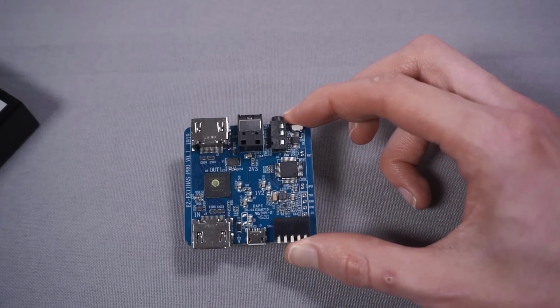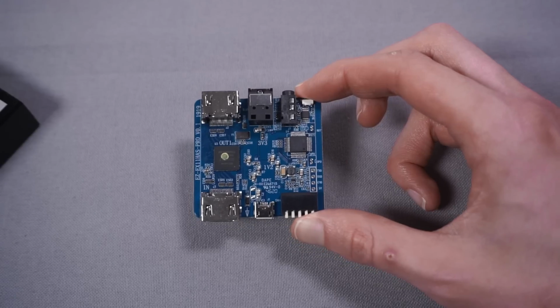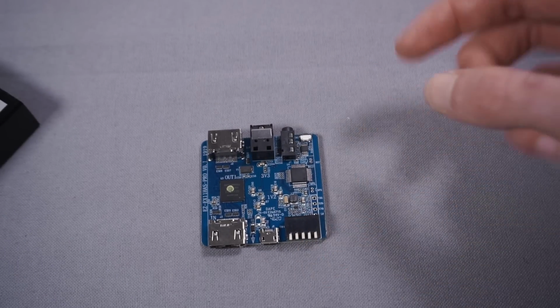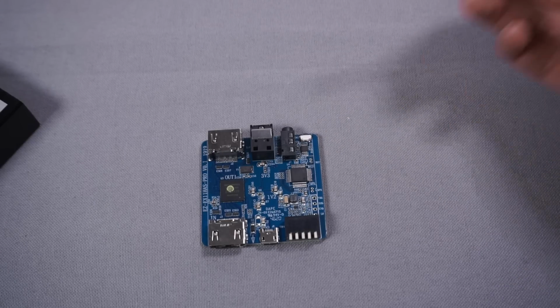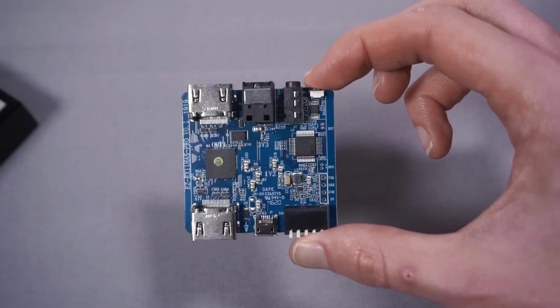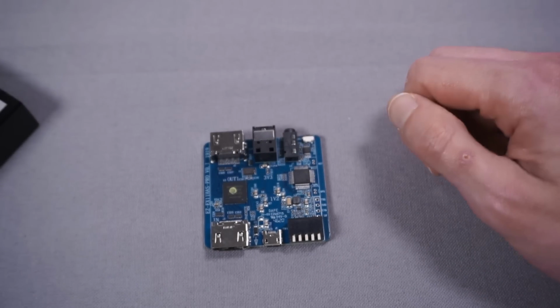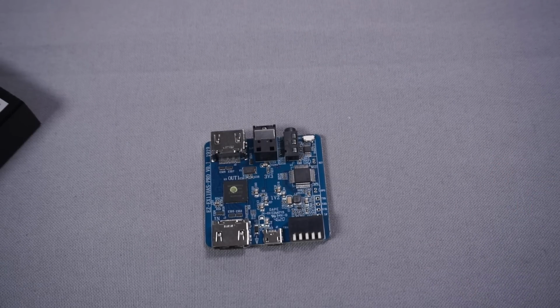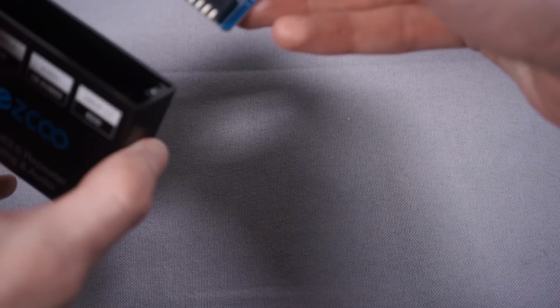It's interesting to see that this is apparently, or at least 344C, is a Cirrus Logic part, because that's a proper brand, and I was expecting this to be a lot cheaper. Now, I don't know if they maybe make knockoffs of those Cirrus Logic DACs or anything, but yeah, the DAC model is 344C, and that's obviously what it's using for this 3.5mm output. And it didn't sound terrible. So yeah, that's it there. So all I need to do is pop it back together and we'll talk about it. But yeah, this thing does seem really pretty good.